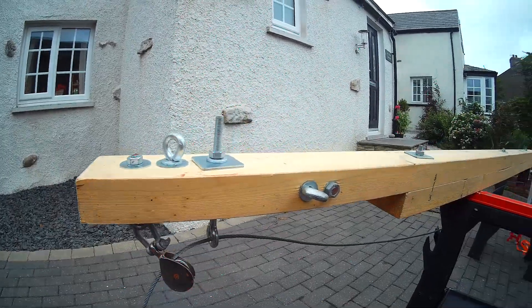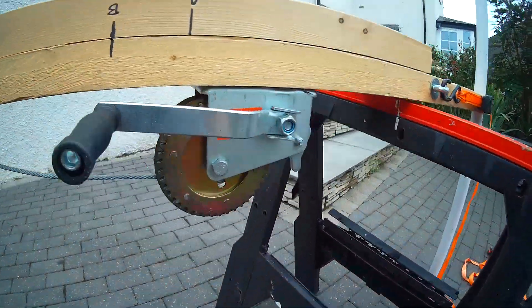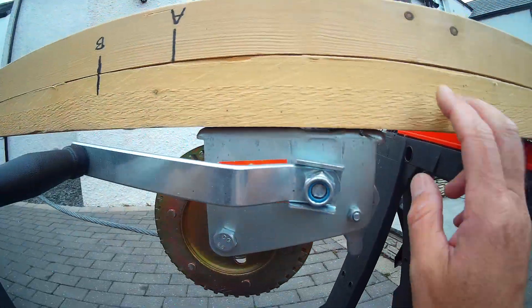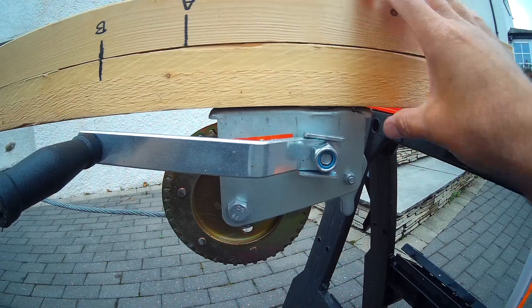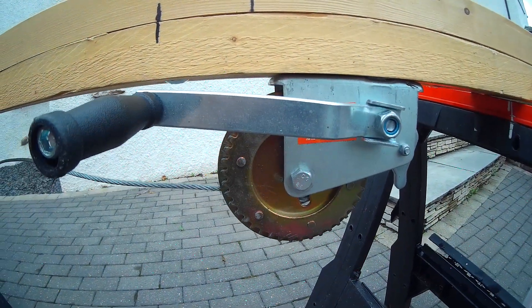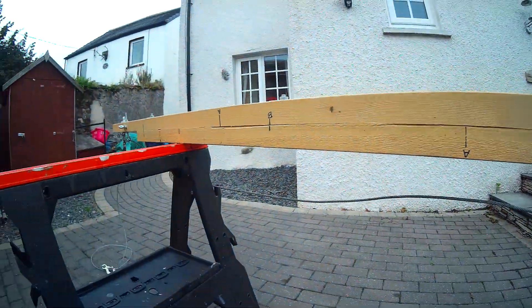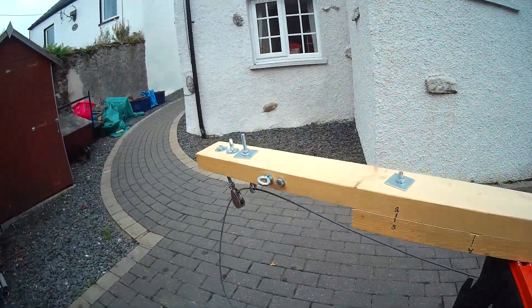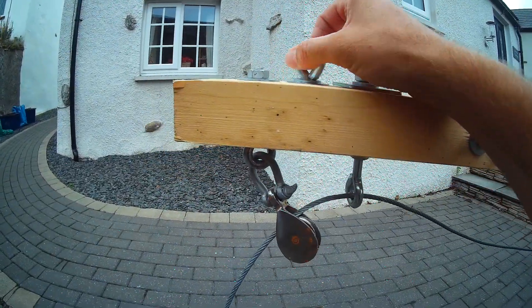Take up a little bit of strain with the winch down here — the trailer winch, which is bolted all the way through this first section of timber. I did bolt it through to make it strong. Then basically I disconnected the forestay, and because the genoa halyard is now attached to this contraption, I can now gradually lower the mast back by just winding the winch.